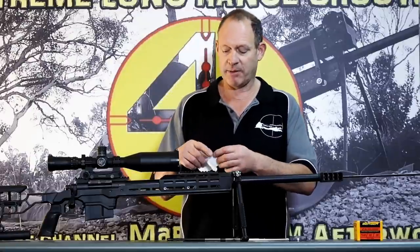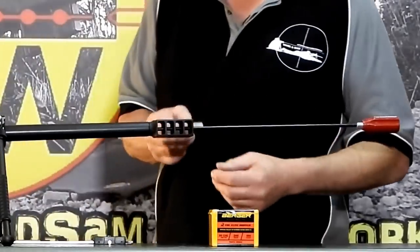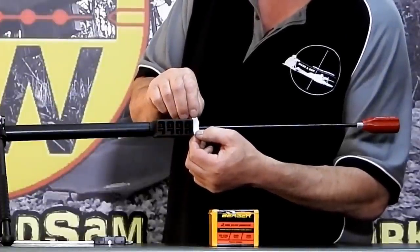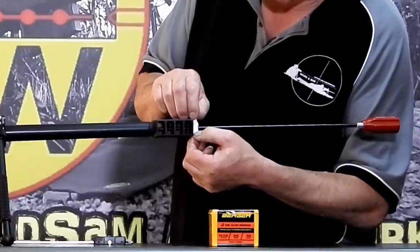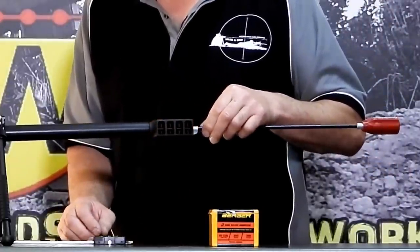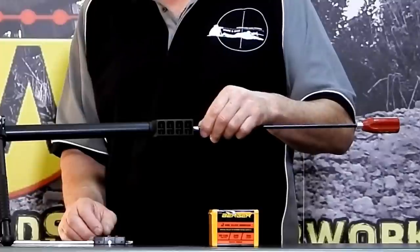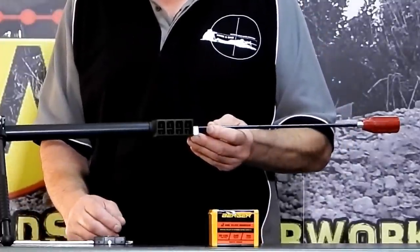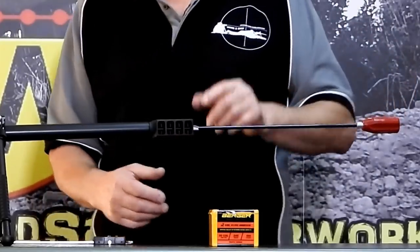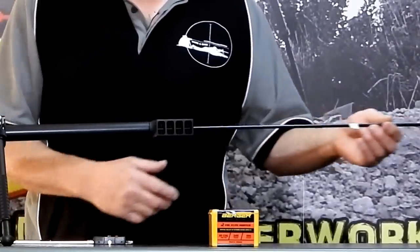With the push-through touching the bolt, I get a piece of paper tape and rip off a piece. I take that paper tape and line it up dead straight with the muzzle — whether it's across the muzzle or a muzzle brake, doesn't matter. I put it on so that edge is exactly level with the end of the muzzle. No preload, no clearance — it's right where it's touching the end of the muzzle. That's the first step.